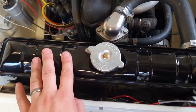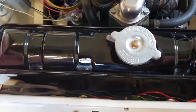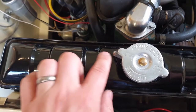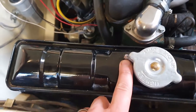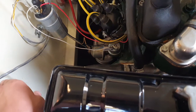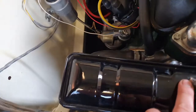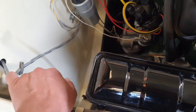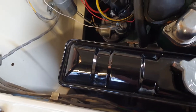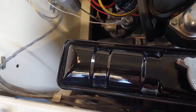Show you the radiator and why we need an overflow bottle. So this is the problem I've got. We've got quite a large radiator head tank here, which is designed to take coolant should it get too hot. But obviously, if it expands too far, you have this pipe here, for venting any gases, any steam or things. Now normally there'd be a pipe that comes out of here and through this hole there. So should your car overheat, this then dumps a load of coolant, boiling hot water, all over your front wheel and your front brake, which is just what you need when you're driving a car. Hot, wet brakes. So we're going to try and prevent it using a bottle to just catch it.